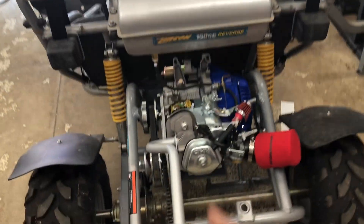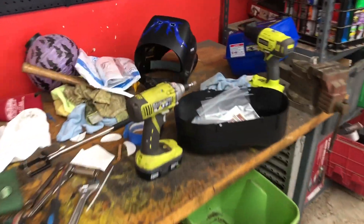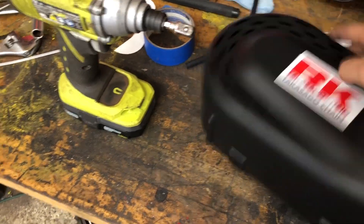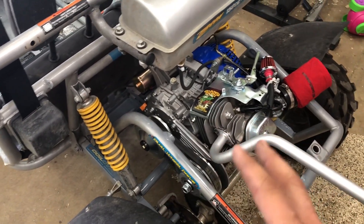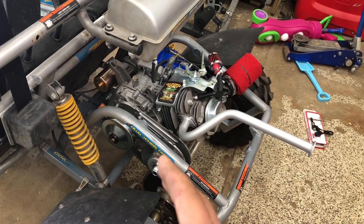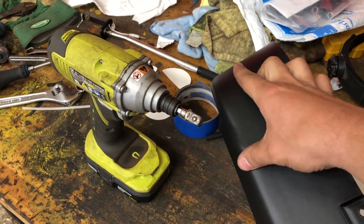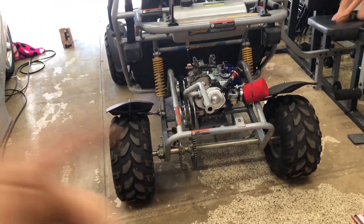She's ready to rock — just need to put some gas in and fire it up. I started putting stickers on the torque converter cover but realized I don't have clearance to slide it in between the shock and the torque converter — it's too tight. I'll probably unbolt the shock and slide it in once I've confirmed everything's working. If I'm out on a trail it'd be hard to remove for inspection, so I may do some clearancing — chop a little angle off so I can still slide it in and out. Most importantly, the wing is bolted back on.